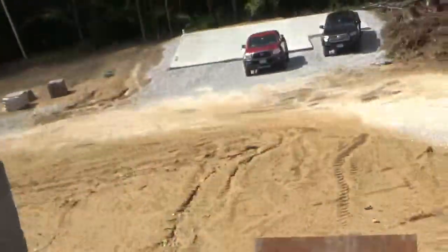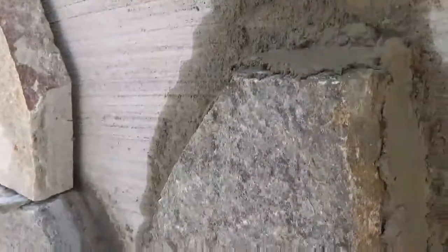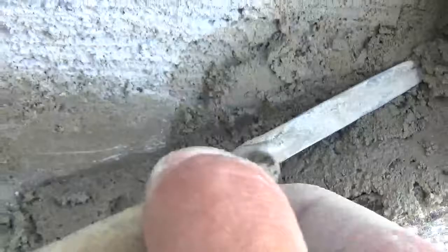That's why it's good to mark out on the wall where your rock is going. Make sure this is completely packed with fresh mud, loose mud — just keep using the loose mud on there. And you will get a little shrinkage no matter what — that's a shrinkage crack right there, and it's just from the moisture being pulled out. It doesn't hurt to take your joiner and just run along that seam where the mortar meets the wall.